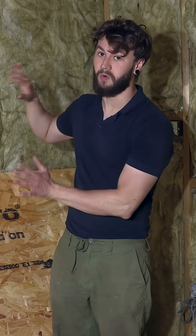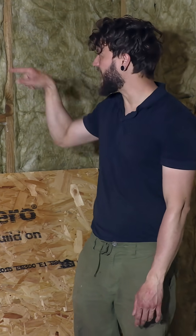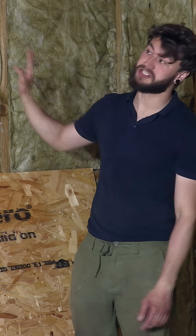Now, there are some benefits to sheathing the internal wall. One of them is that you don't really need wall plugs anymore — you can just screw straight into the wall without having to bother finding the studs. I do plan on plasterboarding the internal over the OSB sheathing, not just for aesthetics, but also to add a little bit of extra fire protection, because this is going to be my workshop.